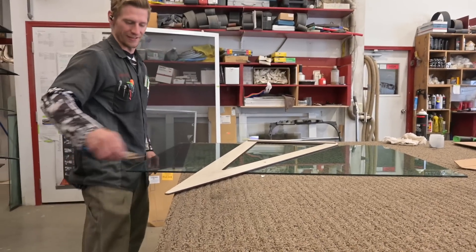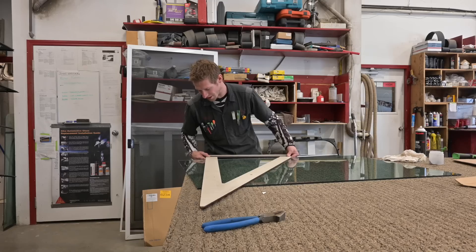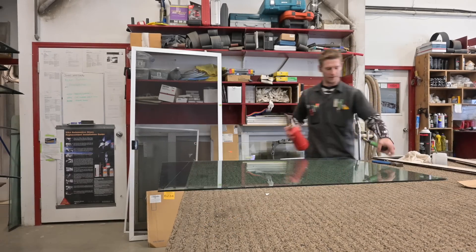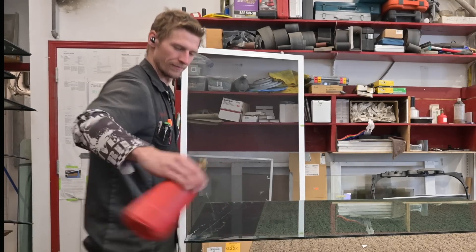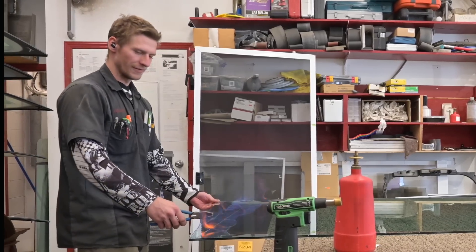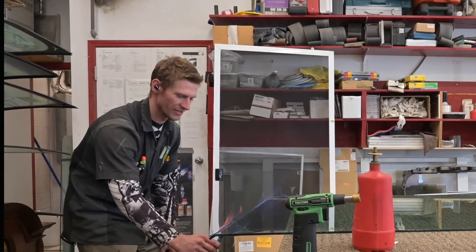Because there are two layers of glass, you have to cut on each side. You start the crack on the edge that you finished the cut on, and then you just direct the crack across the score line. Cut the other side, and the fun part — it's ethyl alcohol. That loosens up the polyvinyl in the center.